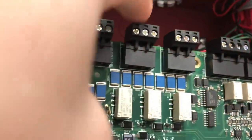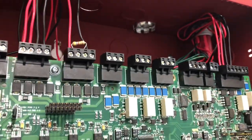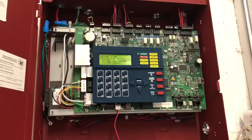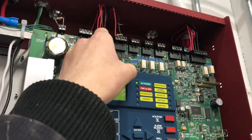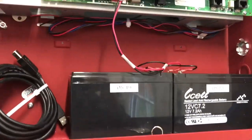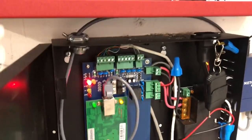The way we're going to be doing that is by opening the fire alarm panel — there are relays on the panel. Right here are three relays; these are programmable, but we want it set to an alarm relay, so if the alarms go off, the door gets opened. When it's an addressable system like this, you could also run it off a control module — a small relay powered off the SLC that will close or open the circuit. But we don't need to do that since this is so close to the fire alarm system, so there's not really any benefit to doing it that way.